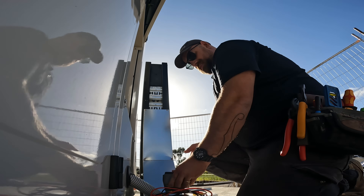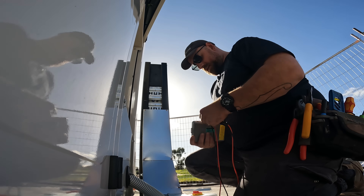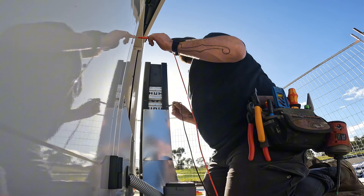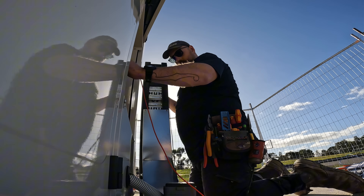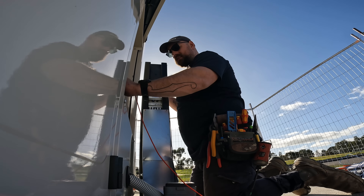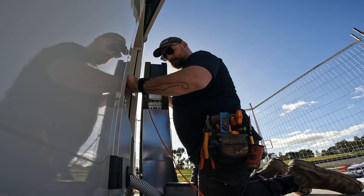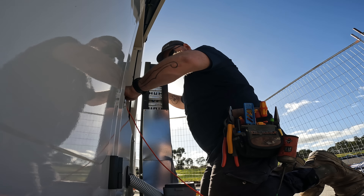Last little test to do — just continuity back to the unit. It's only a one and a half meter run, but I'm really panicky about it. This is a massive thing, and if this thing goes bang — hooly dooly. So basically I'm testing red on white, then testing red, earth, neutral, earth, red, earth, neutral, blue — like everything else — to make sure nothing is touching. Obviously I've tested my earth back to my DB. Frame's earthed.